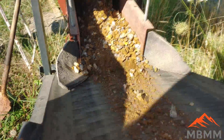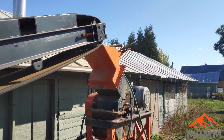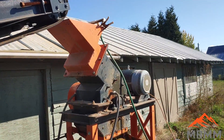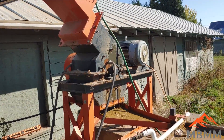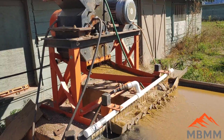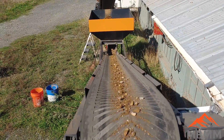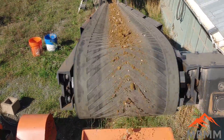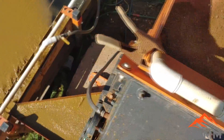Once the material is fed onto the next conveyor belt, it travels up to our secondary crusher, which is a hammer mill. The hammer mill is injected with water on the sides of the case. The material is fed down the top, and inside that case are rotating hammers and a screen around the bottom of the hammer mill, which holds the quartz ore inside the mill to get hit and crushed by the hammers until it can pass through the screen. This hammer mill produces a grind size of approximately 70 percent passing 30 mesh and 50 percent passing 50 mesh.